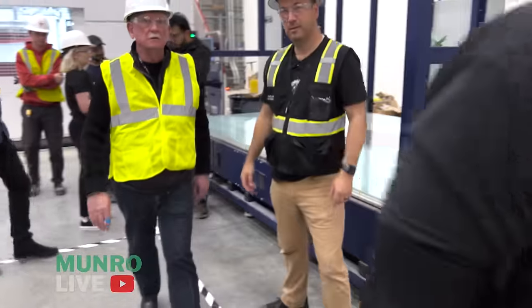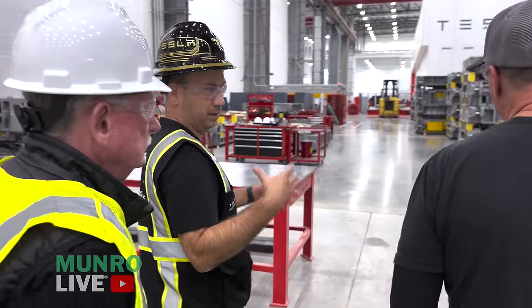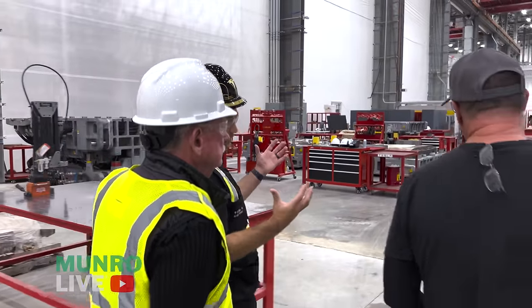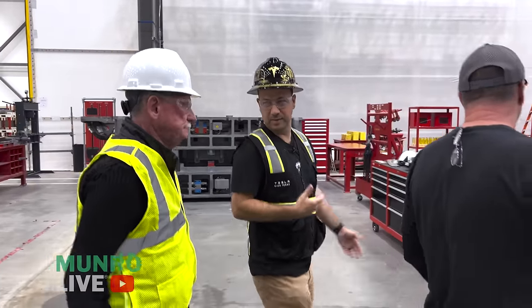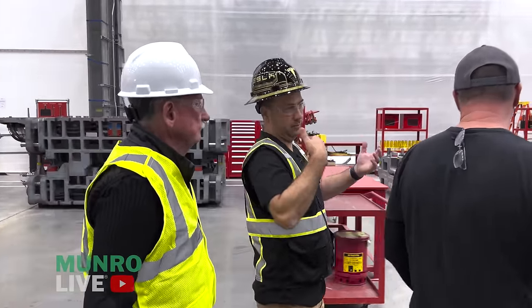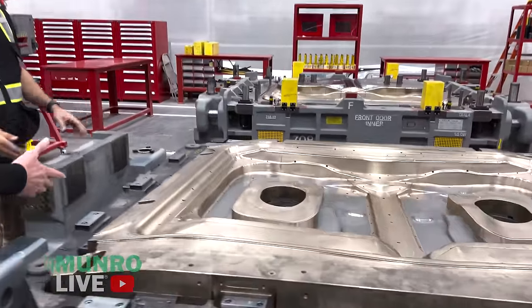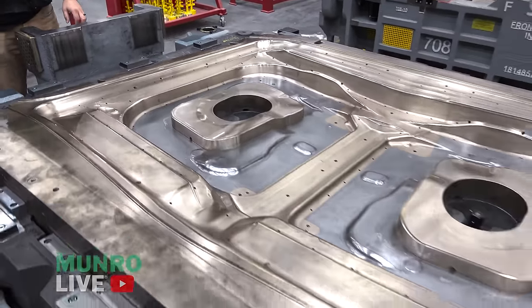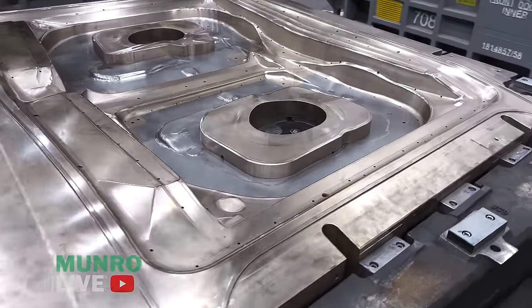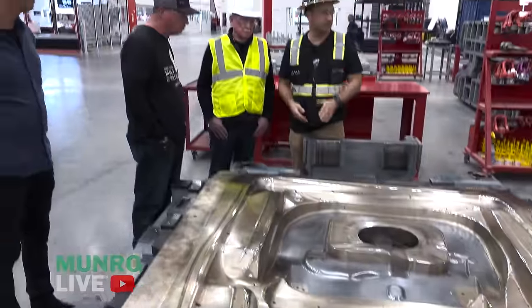This is our die storage area. The inner panels are also stainless but they're formed — having an inner and outer panel gives you much more cross-section. Forming stainless as an A-surface is challenging because you get drag marks. We had to work really hard on this process. This is our front door inner die, and you can see this aluminum bronze coating on the inserts to make sure we don't get drag marks on the stainless.